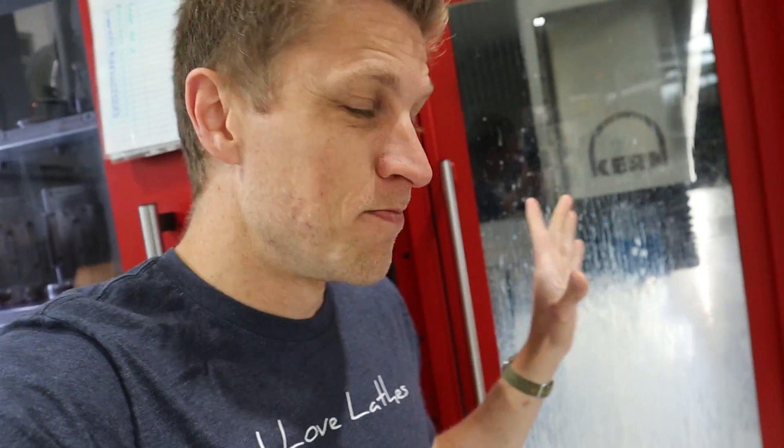After three years of ownership, I've crashed it one too many times. That, combined with running high RPM — up to 42,000 rpm more than I need to — has reduced the life of the upper spindle bearing, causing it to overheat now at 40,000 and 30,000 rpm. It's got temperature sensors everywhere and it thermally controls everything, trying to keep the chilling system — which is basically an air conditioner — at 20 degrees Celsius. If that upper bearing gets to 50 degrees Celsius, it hard-cuts the machine and e-stops it, and we started having that.